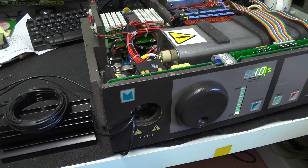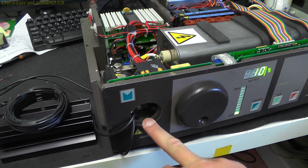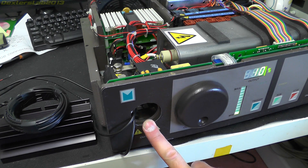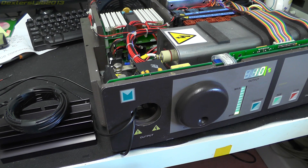That turned out to be a bit of a silly thing to do because I didn't see a load of voltages that I should have seen. But anyway, that's beside the point. All it was is there was one pin on the port that had 5 volts on it and I basically had to just connect that to ground — just pull it low — which was effectively the safety switch which is on the standard coil, which you have to hold with your finger or thumb when you actually hold it to somebody's head. And then you press the trigger or use the foot switch.